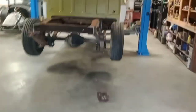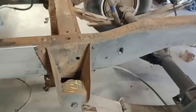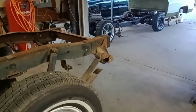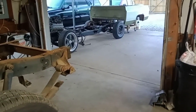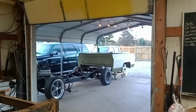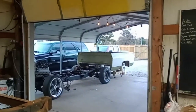That's the easy slash hard part — you better know how to weld. I measure the ground as a long bed, write my numbers up here, and re-measure as a short bed, staying pretty close in tolerance. Measure all four corners, write down the numbers on the frame. So now we're on to the bed — the bed is quite a bit harder. This truck only took me a day to disassemble and take the bed off, but the bed sides take anywhere from three to five days. They're a pain, but what do you do.